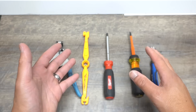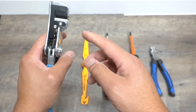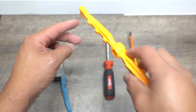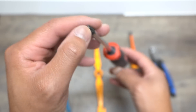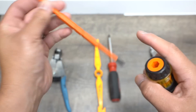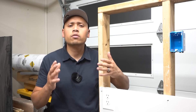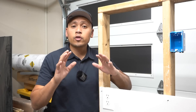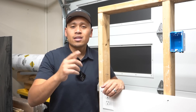Here are the tools I'll be using today. I have a wire stripper — you don't need a fancy one. I have this volt claw, which is great for shepherd hooks and pushing wires into deep areas inside the electrical box. A CX1 screwdriver is great for turning outlet and terminal screws. Klein tools with interchangeable flat and Phillips heads, plus wire cutters. A few important things before you touch any electrical: my electrical codes and yours might be different, so always make sure you're up to date with your local codes. Turn off the power from your circuit breaker before working. If you're uncomfortable with electrical work, please hire a certified qualified electrician. My full disclaimer is in the description below.